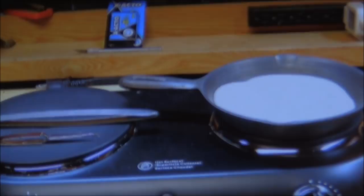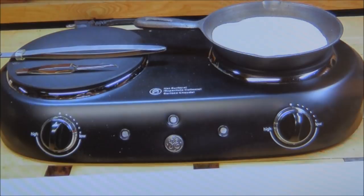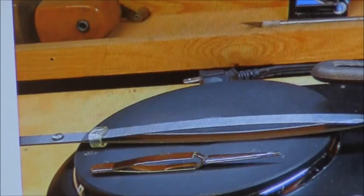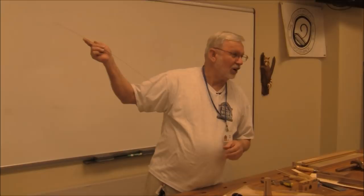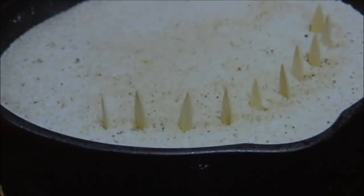I bought a two-burner hot plate because I thought I was going to use a glue pot — a hundred dollars for that glue pot — only to find out it wasn't what I needed. You need a pair of pinchers and the finest sand you can find. A friend of mine who is a member of the Society of American Furniture Makers had somebody in his family bring up a five-gallon bucket from Panama City — that stuff down there is like sugar, it holds heat better and distributes heat better. You only need a one-burner setup. Here you can see where I've got a bunch of little petals stuck in it to be sand shaded — and there they are.